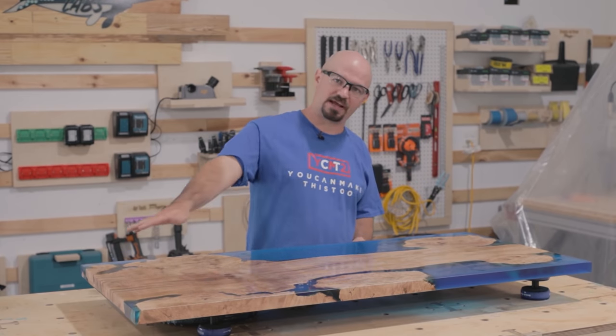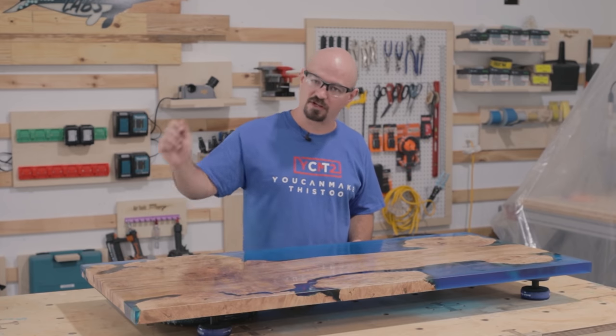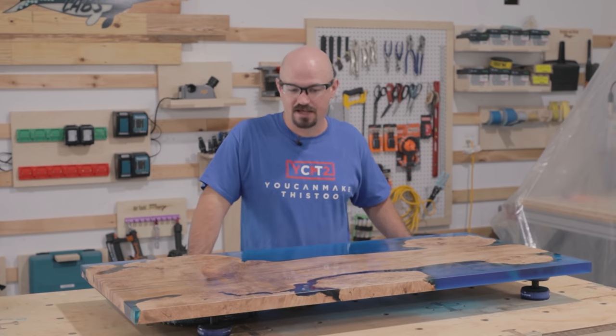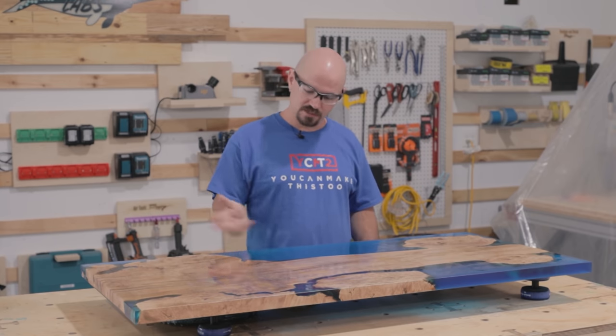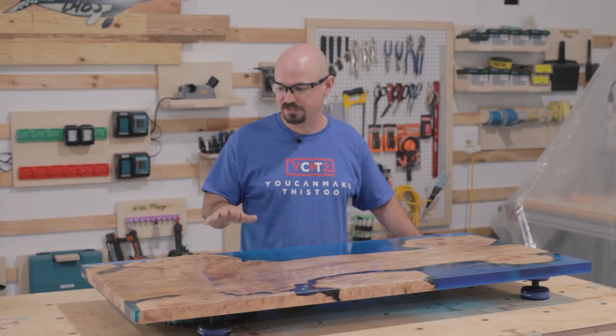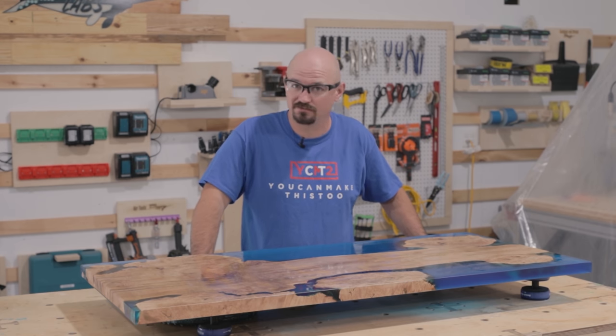So I came in with 400 grit, kind of smoothed out the previous coats that we brushed on, got the sprayer out. We sprayed on one coat of satin to knock the sheen down from a gloss to a satin. And we're just gonna let this dry, make sure we got even coverage, touch it up if we need to, do a little bit on the bottom, and the base is ready. So once the Halcyon's all dried up, we can screw them together and the two become one, and we're all done.